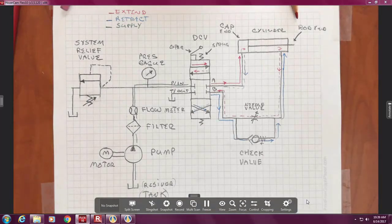Some debris. One thing hydraulic circuits don't ever want is Teflon tape. That gets in there. The clearances on spools and things are tiny, tiny, tiny. 40 microns is a speck of dust you can see, and some of the clearances in valves are 6 microns. Pumps even tighter. So they don't want Teflon tape floating around. And where does it go? If you're lucky, it goes to the tank. But what does the tank do? Pump it and send it around again. And eventually it gets in some component.